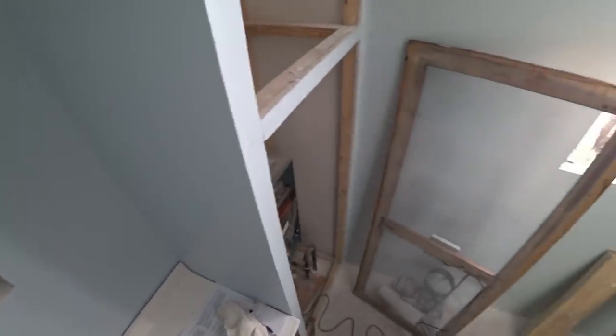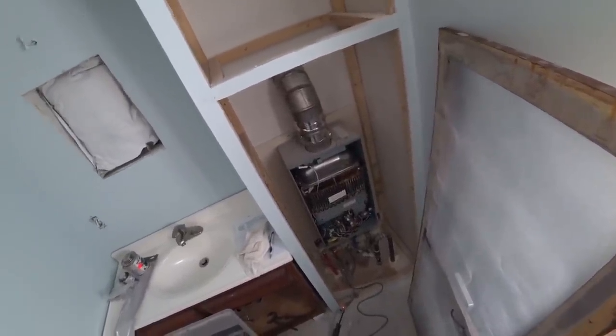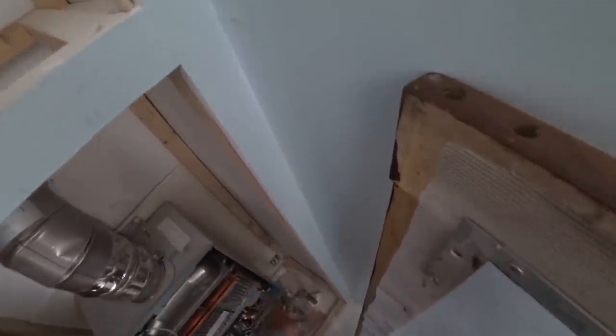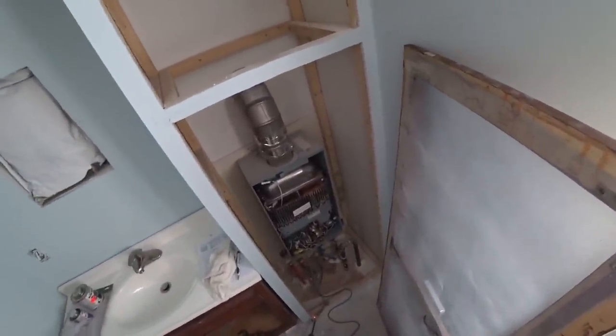I have the same setup at my shop at home for my propane heater - it's the same exact piping. You've got to have a special end on it, it's like a T-thing with some screen things on the end - I think that's what I need up on top. I'm going to wait until I get that, but it works for now and I'll try that on top. I like my setup with how it goes out and up because we get a lot of snow here and I think without that cap the water is just going to pour in. You're supposed to have a half-inch rubber silicone line - you hang it down, do a loop back up, hang it back down, and drill a hole through the floor. It's a condensation drip so if water comes in it goes through that and out instead of into the heater.